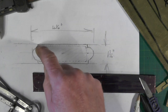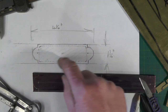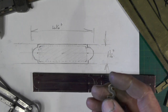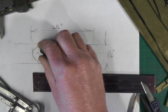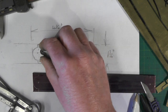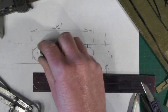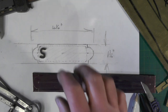So what I'm going to do then — the middle bit here — I'm going to mill it out half the thickness; that'll be a sixteenth to come out. Then I'm going to make some letters, and every letter I make I'm going to stick two pieces of brass together with some double-sided tape, so I've only got to make them once. And I'm going to cut the letters out, split them, and then soft solder them — find some method of holding them in position — and then soft solder them onto that plaque so it looks like a casting.